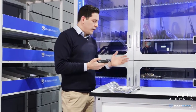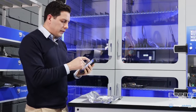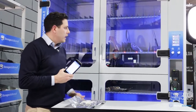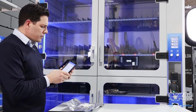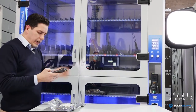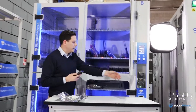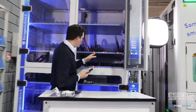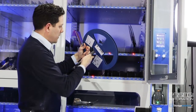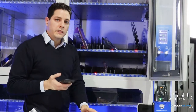The same applies to the dry cabinet — the pick-to-light system. The operator gets extra help: I open the extraction queue and you can see the red LEDs that are turned on. I cannot open this door unless I access with my PIN. Now it's open and I can start collecting. The operator comes to the lit positions and scans the unique ID. The light turns off, confirming this is the material needed.